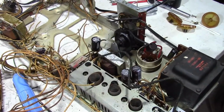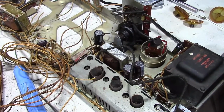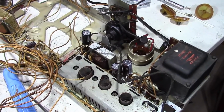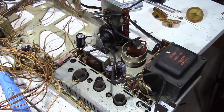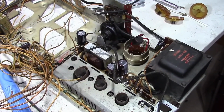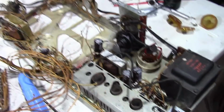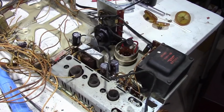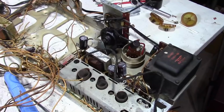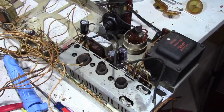And he had had the same oven, and he gave me a tip about it, which was, if you hold down the convection bake button for more than 5 seconds, you can get into dehydrate mode, which lets you dial in a temperature. Defaults to 140. You can go down to, I think, 100. And then he said your oven originally came with a dehydrate bowl or something like that, which included a wood block to prop the door open. So I just stuck a chopstick in there and put this thing at 140 with the convection mode and let it sit for about an hour.